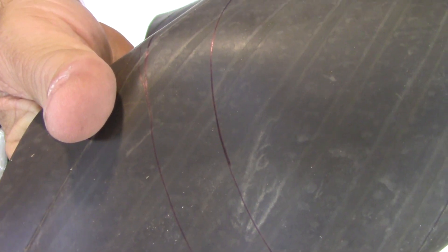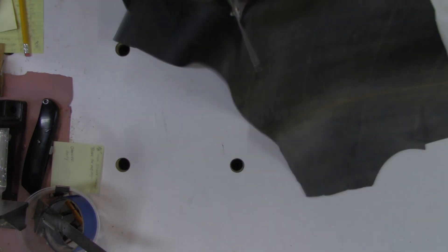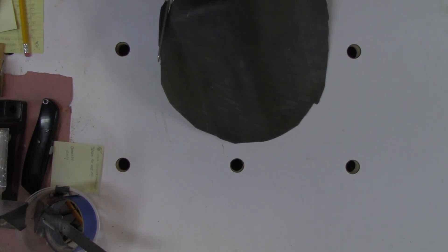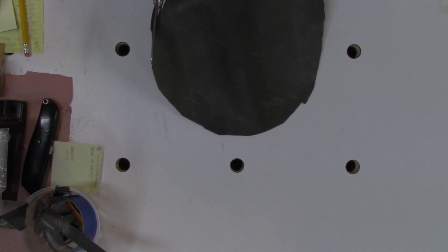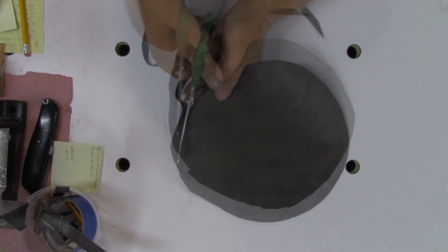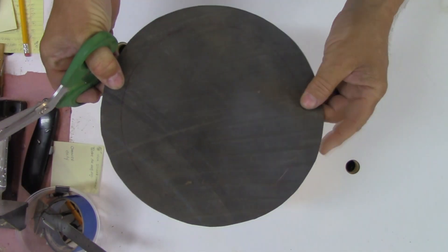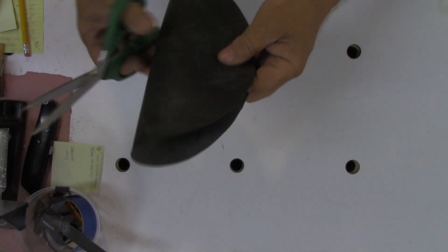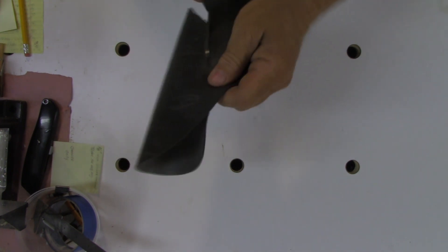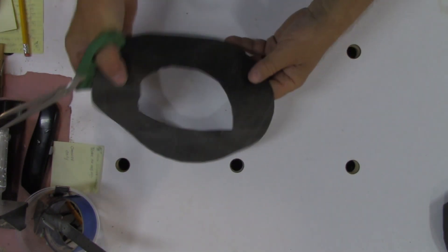You see that mark — there's your gasket. Get it cut down to size where you can handle it, and very carefully cut the line. You have a circle — there's the outside of your gasket. Now to do the inside — these are just regular scissors. Get rid of most of the inside so you can handle it, then cut the inside.